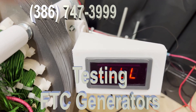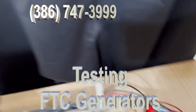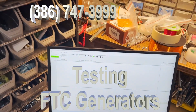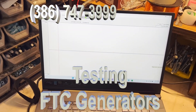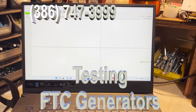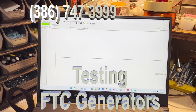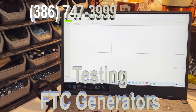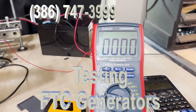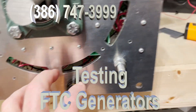This is the battery that we use — it's a 12 volt battery. The Himmelstein requires 12 volts to be driven. Now here is the Himmelstein screen. This will measure the torque coming out of the Himmelstein, so we will know how much energy is being applied to the generator. Here is our voltmeter — we measure the voltage going into the load, which is underneath the desk.